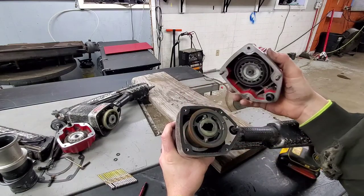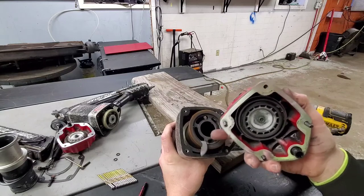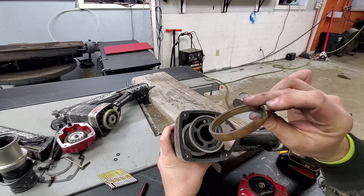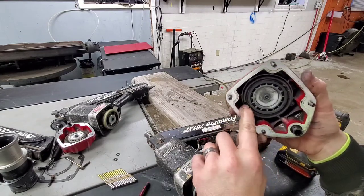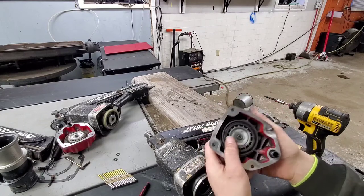Yeah, see that top bumper there is exploded? Yep, completely obliterated. This gasket's, oh yeah, okay, it is busted on the backside too. So it's busted there, it's gonna need replaced. At this point, when they're this bad, you can see up here the top one's cracked also. So it's gonna come right off, the piece we were just looking at on the other one.